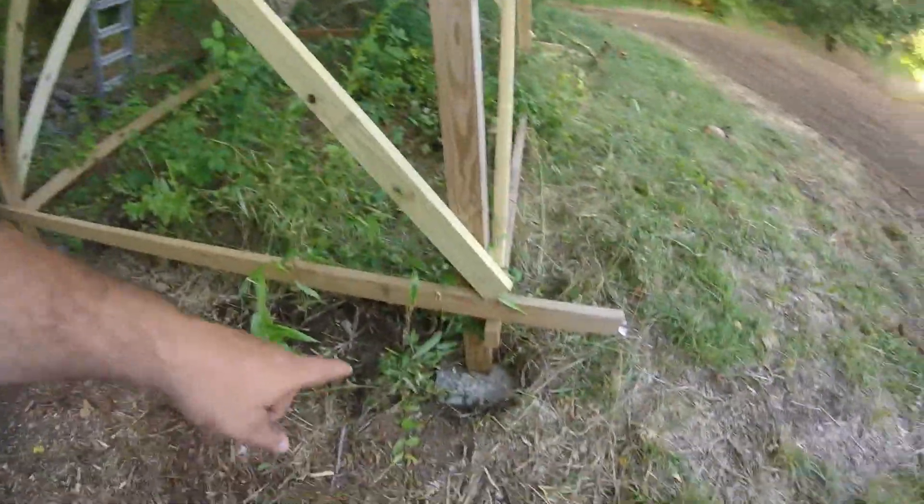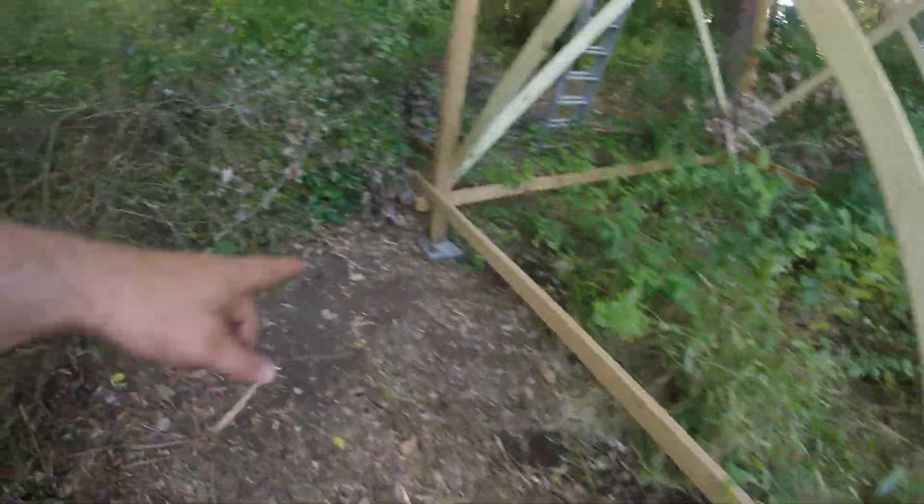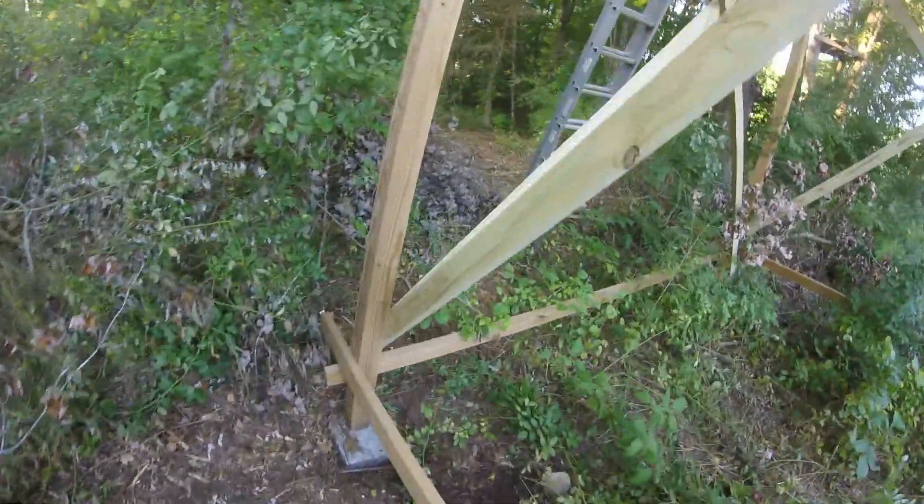Another thing I wanted to add: when I dropped this thing in originally last year, I should have taken the machine and made a nice level base — maybe brought some crushed stone. It may sound like overkill, but this thing is 12 feet high, not 8 feet. So we dug down and put some granite blocks under each foot and leveled it before we put the walls up.